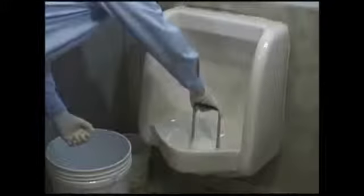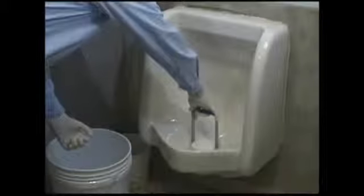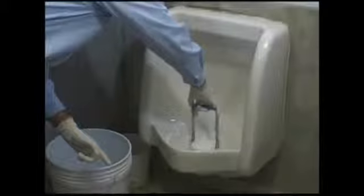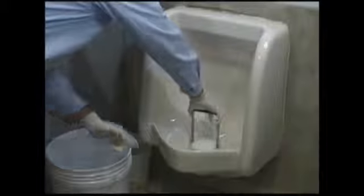To replace the Ecotrap, insert the Extraptor tool into the trap ring knobs. The Extraptor tool has notched tabs that, when turned, will lock the Ecotrap in place to avoid slipping. Turn the tool counterclockwise to lock it in place.